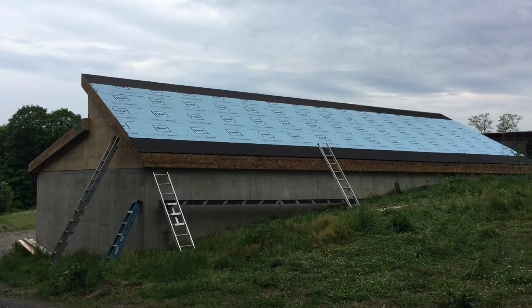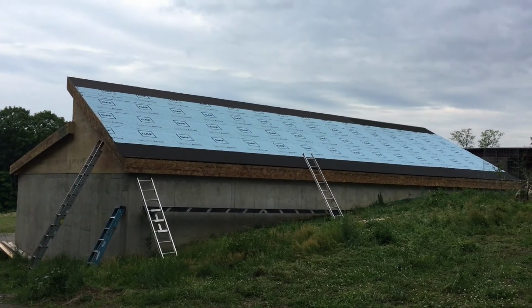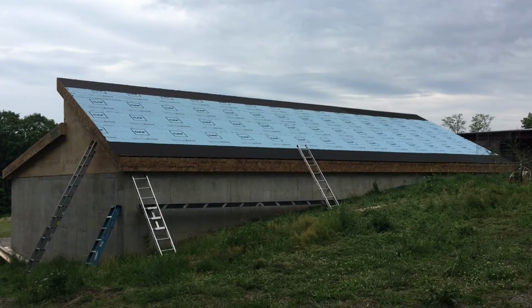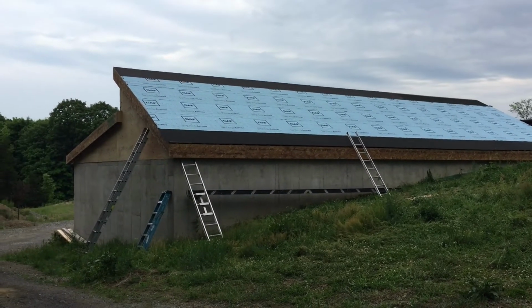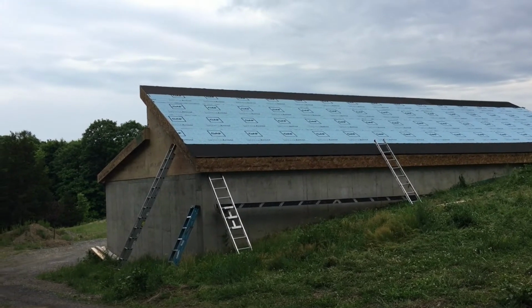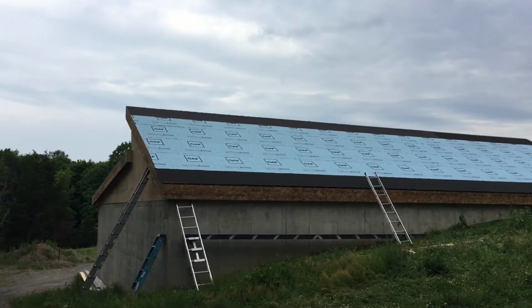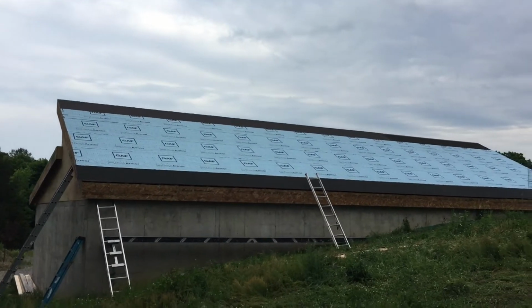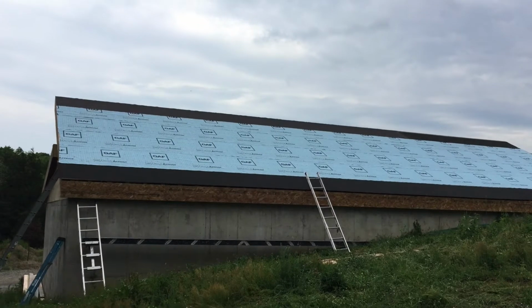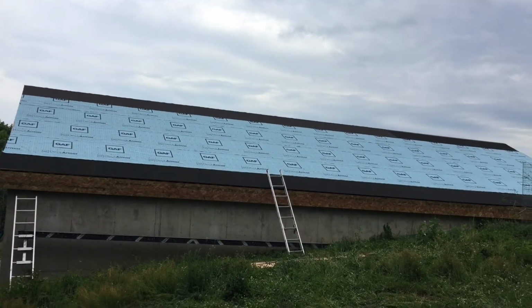Well, it's just after 1 o'clock in the afternoon, and this is the progress. So this is the north side roof. As you can see, it's got the water and ice at the top and bottom, and then all through the middle it's got a product called deck armor. And except for just doing a little razor knife trimming of the overlap on the end of the fascia board, or the rim joist, I guess, because the fascias aren't on yet. Other than that, it's pretty much dried in.